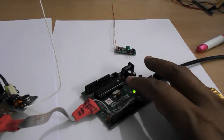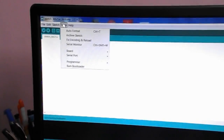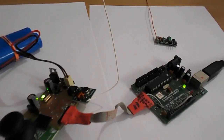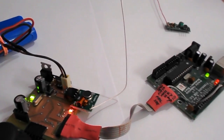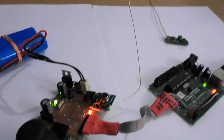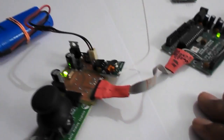The serial port is COM3 where the Arduino board is connected. Now I go to Tools and click on Burn Bootloader. You can see the fast blinking has started, indicating the bootloader is being burned on the microcontroller. Now it is completed — you can see it is written that the bootloader burning is done.